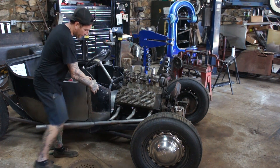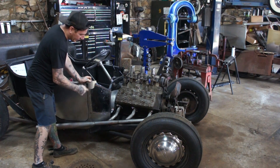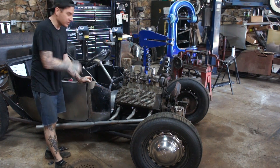Sometimes even your knee works. So I've kind of got this fit up here. I'm going to do this first patch and trim it to shape, tack it in, and then we can weld it in and move on to the next part of getting this all tied together.